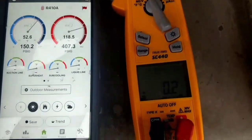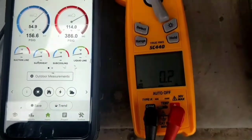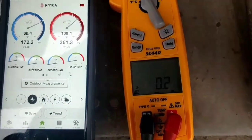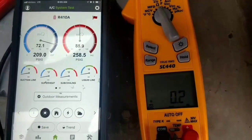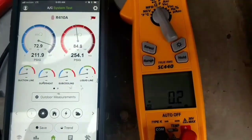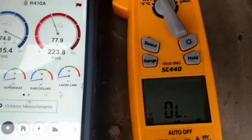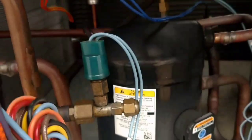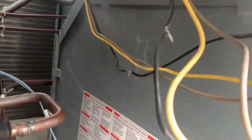Now let's see when it shuts off. I wonder if it's going to open up at about 300 or so. It opened around 240 psi — about 80-degree condensing. It's a little low on the low side, but maybe someone installed it afterwards. We're just going to reconnect them back up. That's all the problem is — head pressure issues.